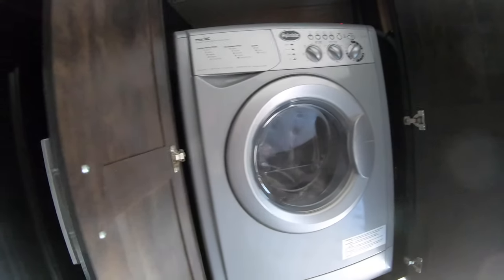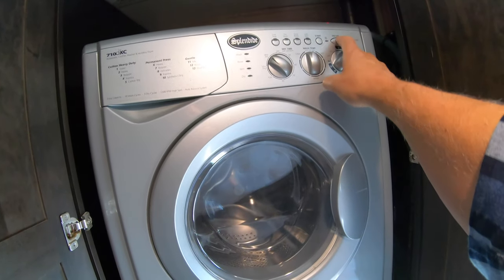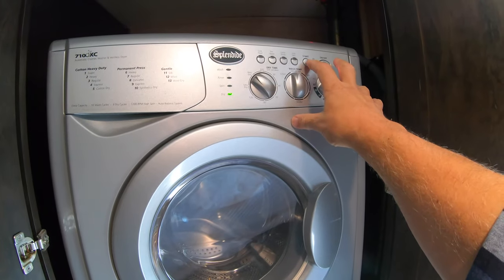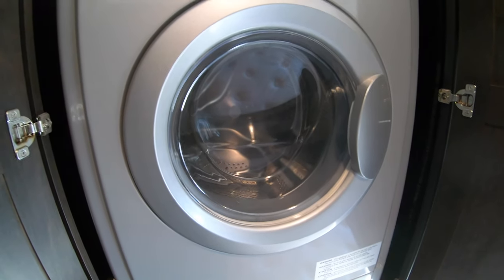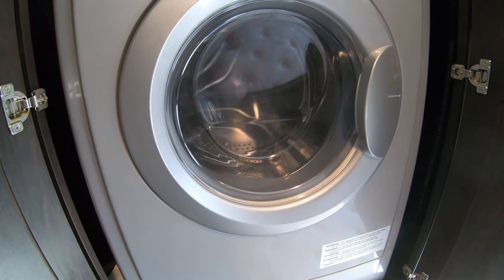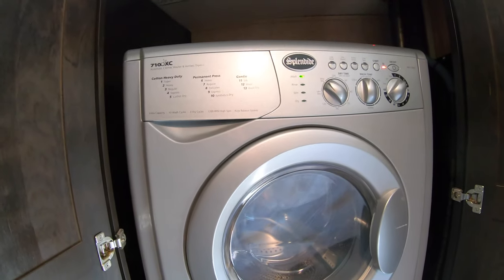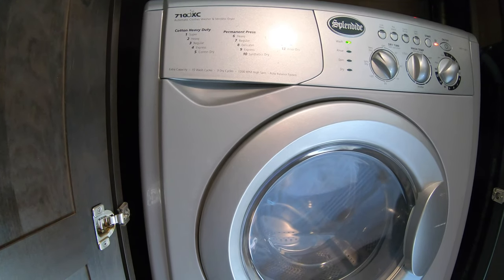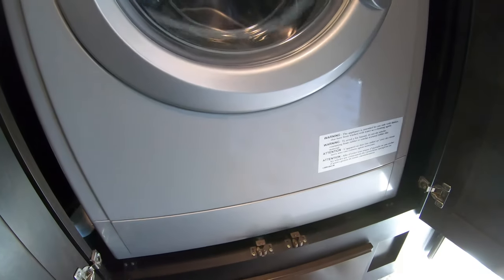All right, let's go back and we'll do the washer and dryer right now. And I'm gonna do the same thing. Just leave it on both hot and cold. We're gonna turn it on as if we're doing a normal wash cycle. And this time we want the pink antifreeze to go into the system. You can hear it now that it's pouring in. And we want it to fill up quite a bit, at least so we can also go through the pump.